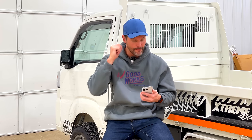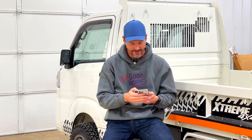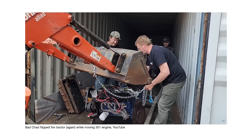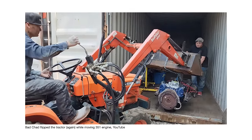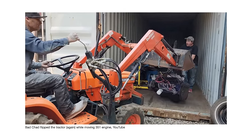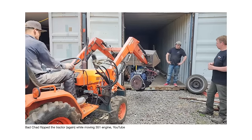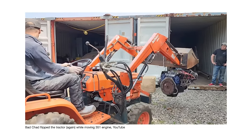The first video we're looking at here is from Bad Chad. It looks like he's got a good channel, and from the sounds of his video if you watch the entire thing, this isn't the first time that he's put himself into a dicey situation with his Kubota. This is an older Kubota — I think it shows the model at some point — but he's lifting up an engine with the front-end loader, chaining it onto the bucket. It's a pinned-on bucket, so that's pushing the load out further. The closer you are to the loader frame, the more stable it's going to be. The more weight you can lift, the more stable it's going to be as well.